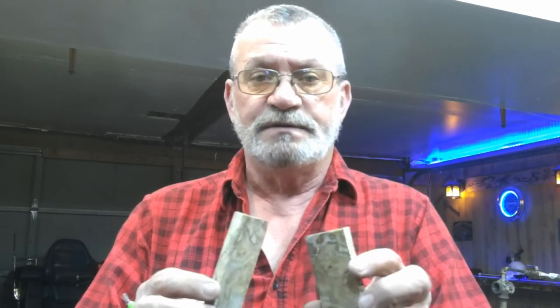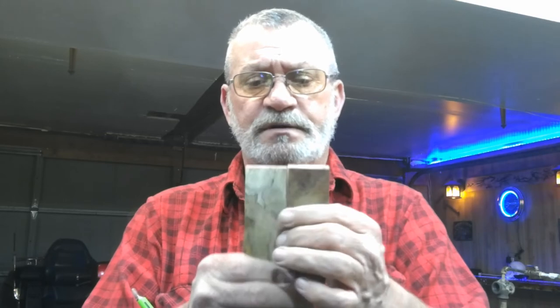somebody that knows what I'm talking about maybe could say something in the comments. It's like bars of mercury, you know, like the atmospheric pressure. Anyway, it was at a negative 24, and for 5.5 hours, it was pretty much as high as the vacuum would go in the pot. Then another 2 hours of cooking them in the oven to get the resin to cure, because that cactus juice won't cure without heat. So there they are, pretty cool. First time I tried that. I think these are gonna make some great looking knife scales.